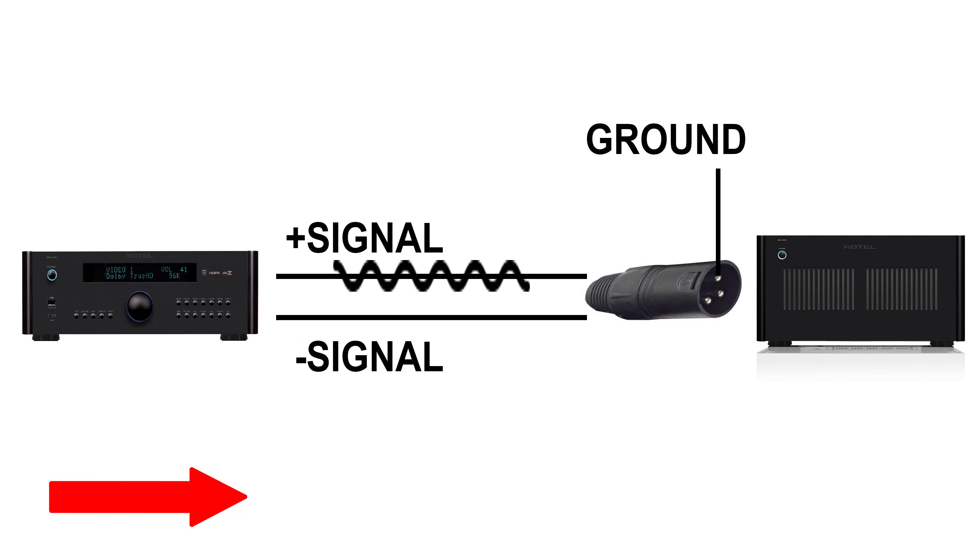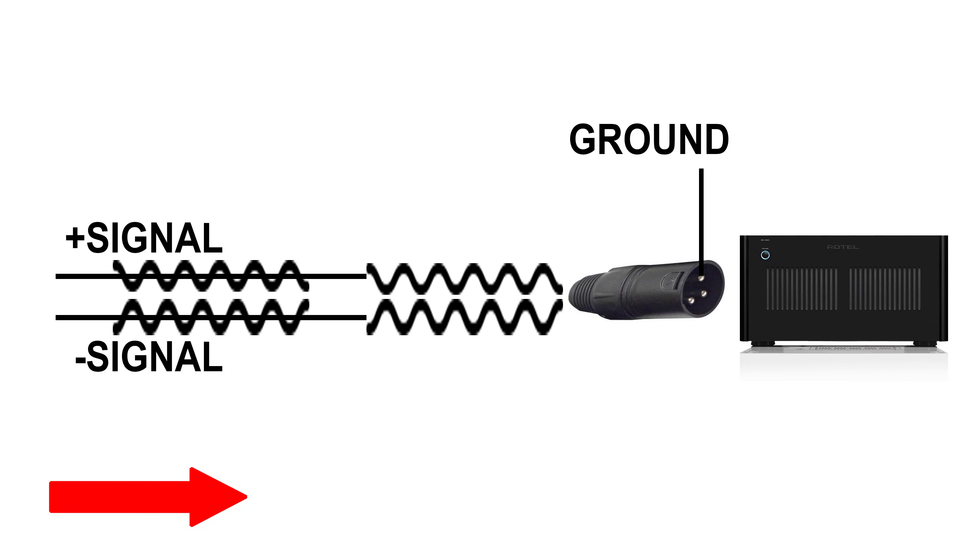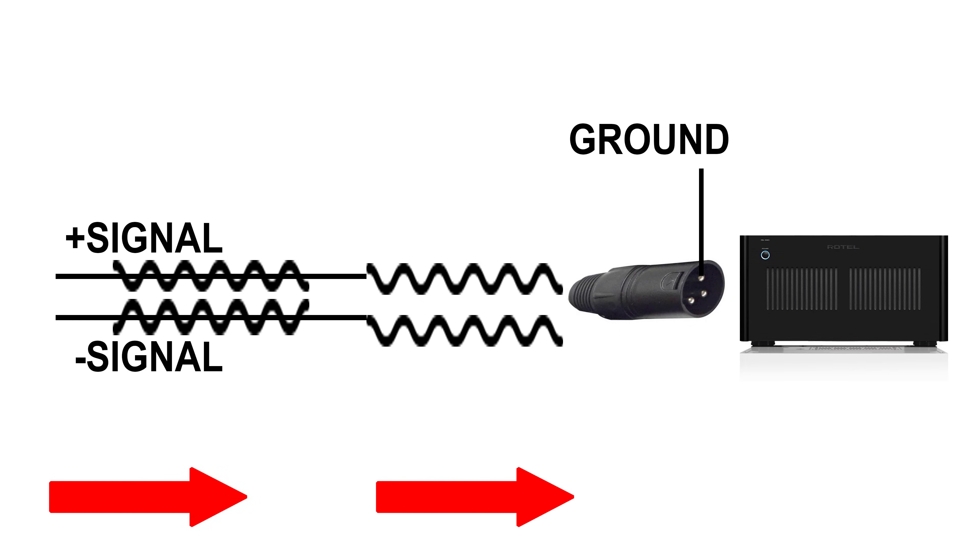It's flipped by 180 degrees, or reverse polarity. So when the signal is traveling from one end of the cable to the other, they'll cancel each other out. Now if any noise were to creep into the signal path, then it'll be cancelled out as well, since any noise would also be on both pins and out of polarity. When the signal reaches the end of the cable, the out-of-polarity or negative signal is then flipped so that both signals are now positive.